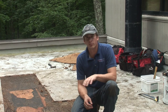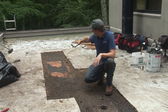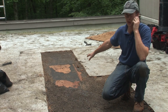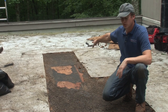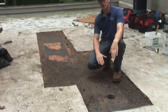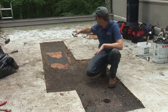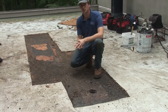Alright, I have all the prep work done now. I stripped it down and had to angle it from that end where it was too low all the way down here. You can see where the hump was — I had to go all the way down to the plywood because that was what was creating the hump in the first place. They built it with a hump in the middle, so we left more material on the other side to make that higher and it all slopes down to the drain, making this the lowest point now. Now we're going to cover this all with our membrane and seal it up, and this is now going to easily drain that whole puddle over here as well as the puddle I showed you earlier.